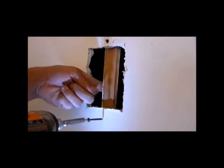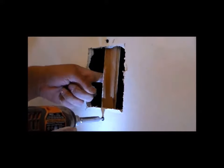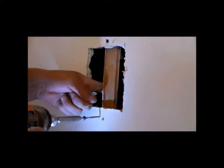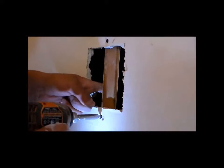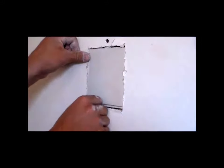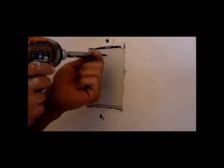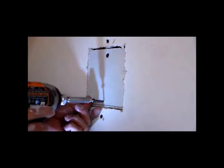because that stick will have a tendency to go into the wall. And once you get that in place, Rudy missed it there. You know. All right, and then that's good and secure. You're ready for your little block of sheetrock. And then, how's it fit, Rudy? Fits pretty good. And so you're ready to put a screw in that now. There you go. Once you get the screws in, you're ready for your mesh tape.